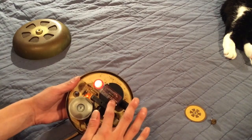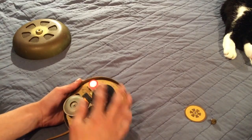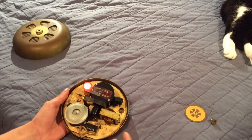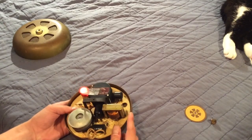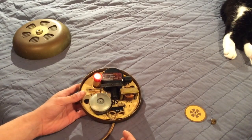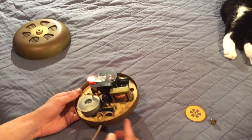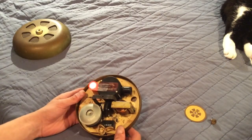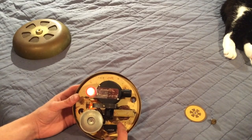Here's the sensor chamber right here. Right here is the end cap, the receiver for the beam from the light bulb. And right here is the photoelectric sensor. Here's the transformer, and here's the horn — the horn is a Deltalarm; this one has a Deltalarm horn in it. There's a relay right here, which I think is what I heard click when I plugged it in. And then there's another neon lamp right here, but I'm not sure what that one does — that one's not lit.